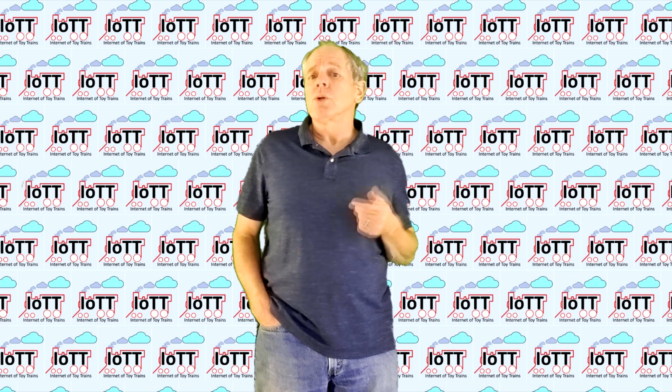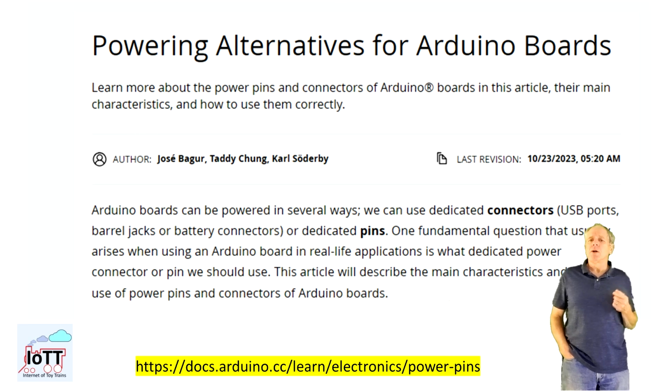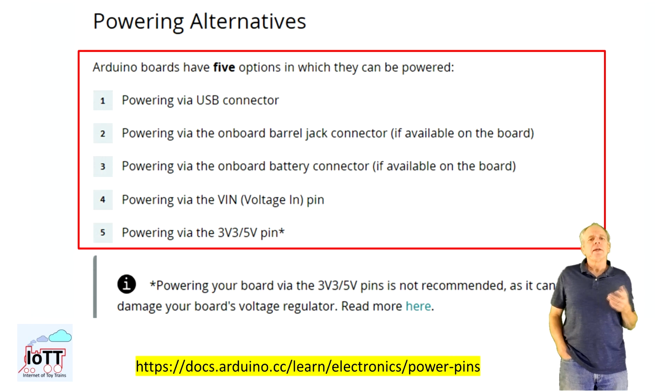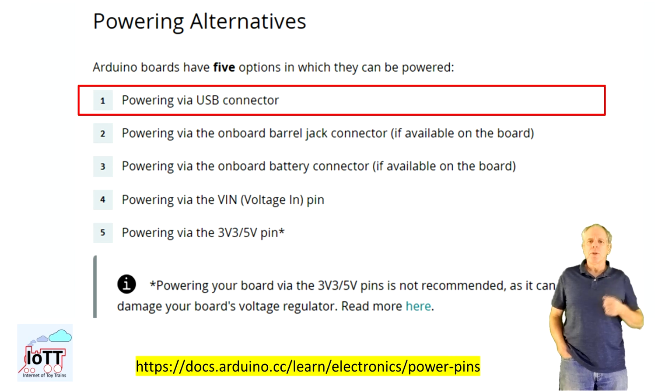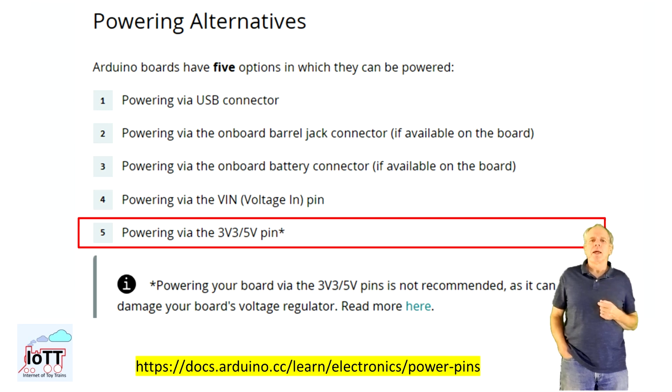The first topic to look at is the available power options for an Arduino. There is an excellent paper in the Arduino repository that describes that in detail. The link to the document is in the description of this video. There are 5 different ways to power an Arduino, but there are only a few boards that actually implement the battery option. So here I just look into the options that are available on most boards: USB port, barrel connector, V-in and 5V pin. Let's have a closer look and understand the characteristics and differences of each method.